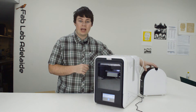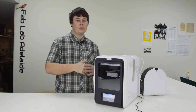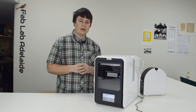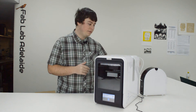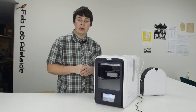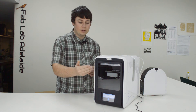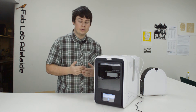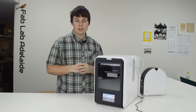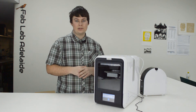There are a few disappointments with the UP Mini 2. First, the filament caddy is designed to hold a 500 gram reel, which is fairly small — I'll likely end up using a turntable with larger reels instead. It's also quite difficult to feed the filament through the rubber piece and into the PTFE tube, especially with big hands. The extruder vent is now a slidable cover rather than the old flip handle — but from the front there are no visual cues to show whether it's open or closed, and it's very difficult to access once the printer is initialized. There are also no jog options on the touchscreen to move the axes for easier access.